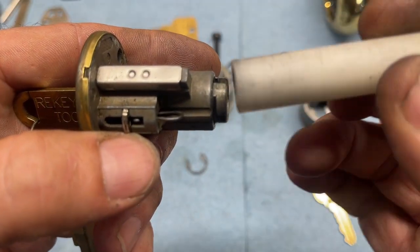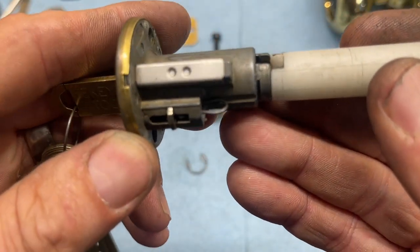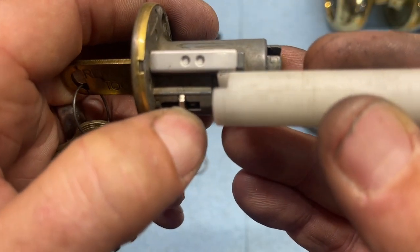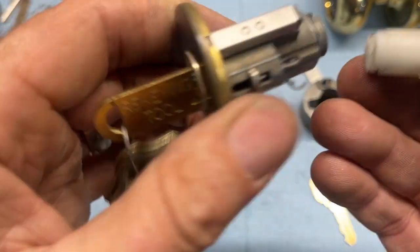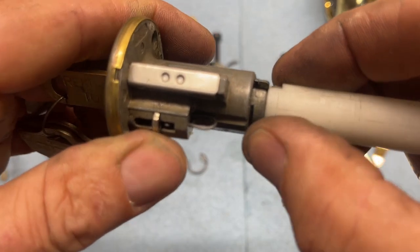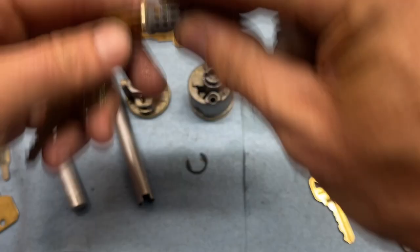Again, if you're not checking for top pins, just do this. But here we want to have this opening, and I want to show you why. So what we're going to do is align this so that when it follows through, it'll cover both the area where this is trying to drop down and the top pins. And that's at about 10:45, 11 o'clock position. And here we're going to angle that right about there, and then shoot it through as quick as possible. No harm, no foul. So let's set this aside.